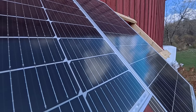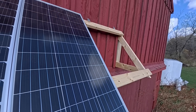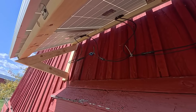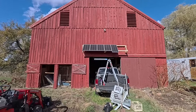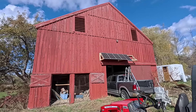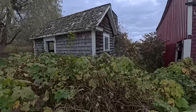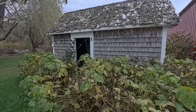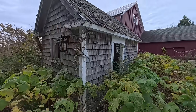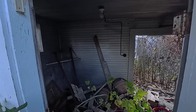The keen observer will notice some bare frames sticking out past the solar panels. That's because I wanted space to add more panels in the future, and I built the frame so it could be lengthened — I've calculated it could hold about two kilowatts worth of panels. This is a pilot project; if it's wildly successful, I'll make it bigger. If I do, I hope to convert that little leaning shed into a powerhouse — it's disused, nicely built, and I've confirmed it's not actually falling over, it just settled.